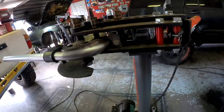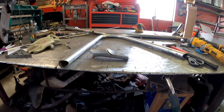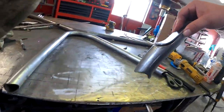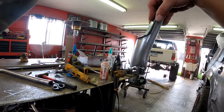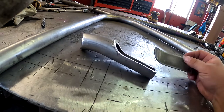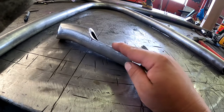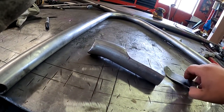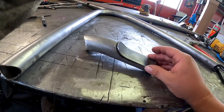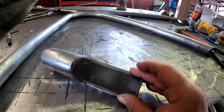That's going to be our hoop. Here is my latch mechanism - this is going to be my mount. This tubing lands on the bumper like that and it leans in. I have the piece of tube cut in half with the cope of an inch and three quarter pipe right there. Then I made this plate and curved it to match, a little bit skinnier so I can lay a nice weld all the way around.